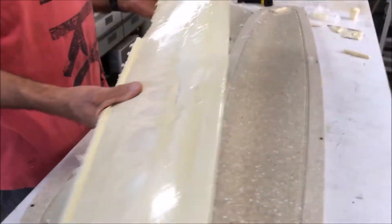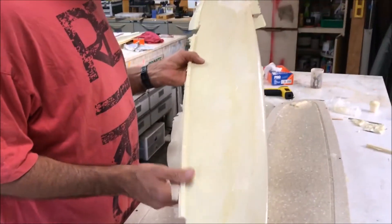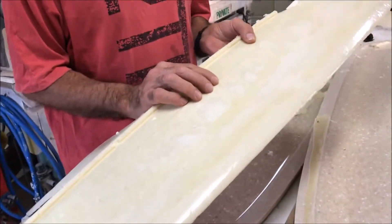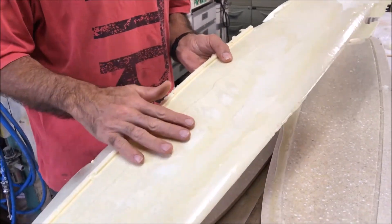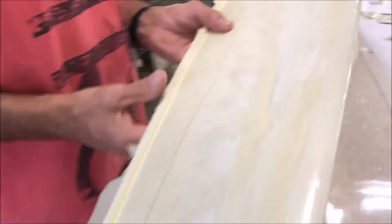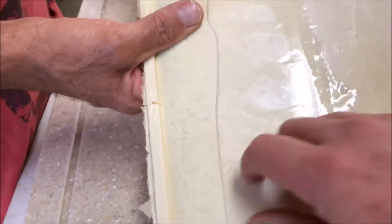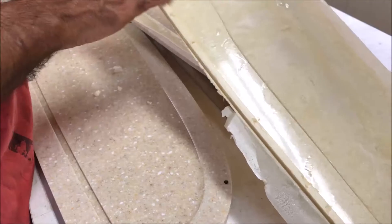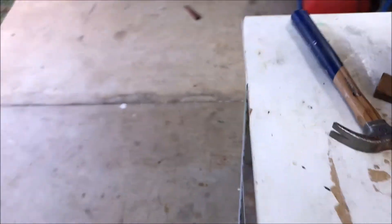Okay, weird. I thought that was going to be a 100% fill but we've still got problems with air gaps — the quest continues. You know what this might be — you know how the mold started to bulge under expansion and then we crushed it down harder again with the clamps? This may represent where it had come out and we squished it back in again. It's actually a ridge and it's very shiny, which makes you think it was actually in contact with the surface.